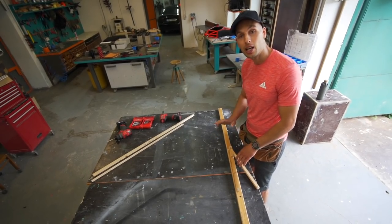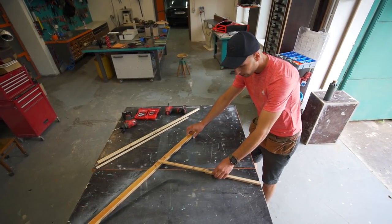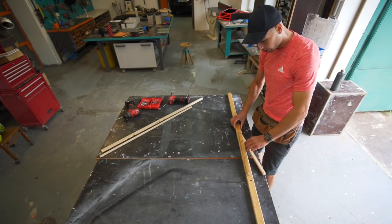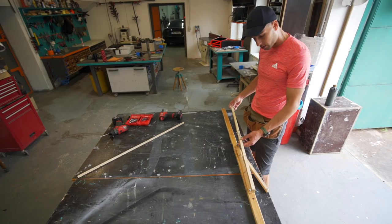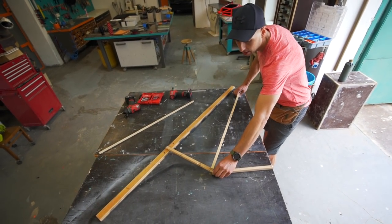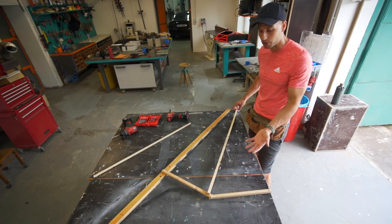The half scissor mechanism was heavily requested. Here is how it's supposed to work. We have the solar panel attached here, and a simple mechanism opens and closes the whole thing. Look at that, it has a pretty low profile. This is my actuator, which is retracted, and this would be the extended version of it. It can be replaced with a threaded rod, but I find that a more complicated solution.